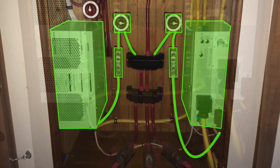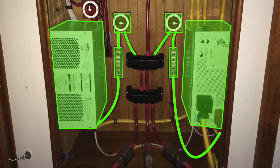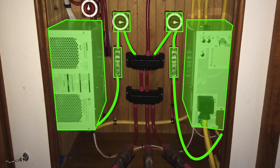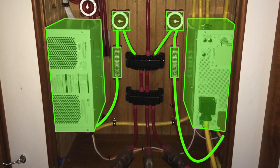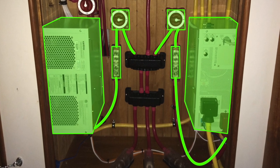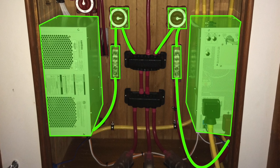Chicory utilizes a pair of 3,000 watt 12 volt inverter chargers. They're in stack configuration so they have 6,000 watts of total AC power supplied to the AC breaker panel, and they can charge the batteries with a continuous charge of 300 amps.